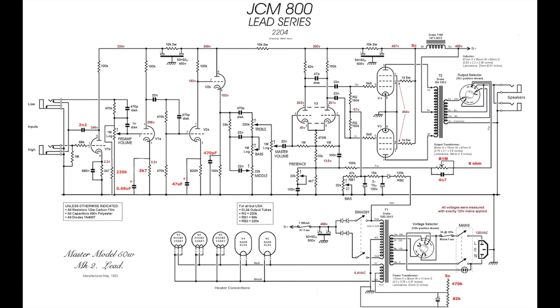Your guitar signal follows the same path, from the high input here, through the 2N2 cap, through here. There's a 220k resistor to ground off the preamp pot now, so it just reduces the gain a little bit, because some of the mods in here result in the amp being able to produce pretty high gain, and it gets a bit out of control. With the switching mods here, we've implemented a FET boost, we've got Jose clipping, there's more gain than you can poke a stick at, so this kind of helps just keep it under control a little bit.